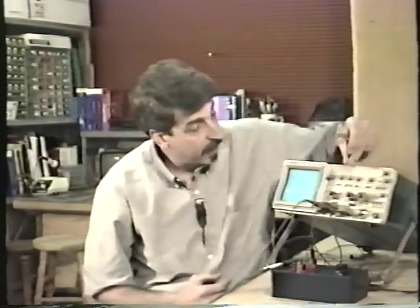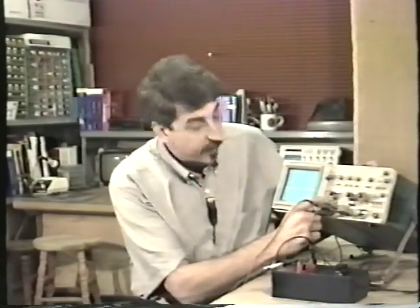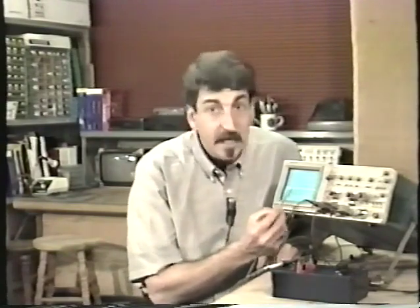You can't really tell what you're looking at here even. That's 1/millionth of a second for each horizontal division. Then half a microsecond, 0.2, 0.1, and finally the fastest speed is 0.05 microseconds per division. In fact, the beam is flying by so fast I actually have to turn up the intensity to even see what we're looking at. And what I see is a tiny little bit of what's known as ringing over here. It's really barely discernible, and nothing unexpected certainly. But right now this beam is moving really quickly from left to right. 0.05 microseconds per division. That's 50 billionths of a second for the beam to move each horizontal division on the graticule.